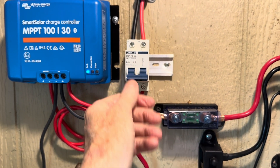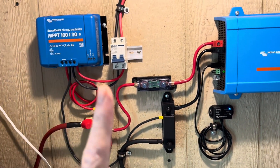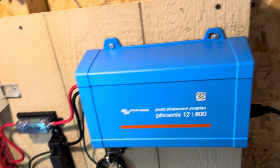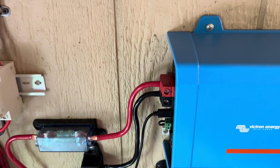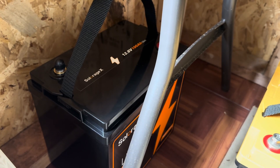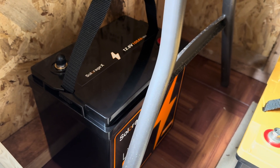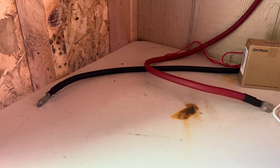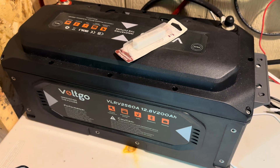The first thing I'm going to do is go ahead and disconnect the solar from coming in before I start disconnecting this battery. I do have some light going on just up there — it's nice and light in here right now. Then we'll turn the inverter off, which is over here. Light went off, no power going through there now. Got that disconnected, and I'm calling that one on the shelf — it can sit there for many many months without needing to be charged, so it's in good shape for storage.